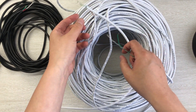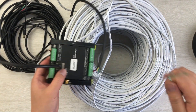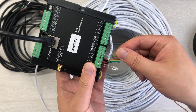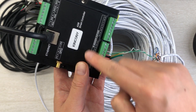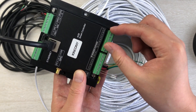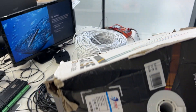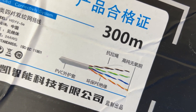I'll power off the controller and connect the third channel — third positive and negative. The third IR cable is connected, alongside the first. ESPHome with ESP32-S3 supports four channels simultaneously; in the future our KCS firmware and Arduino source code will support eight channels by switching GPIO assignments. I power on and test. You can see the Cat5e cable — 300 meters, brand new.